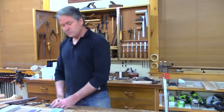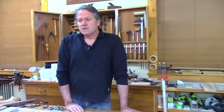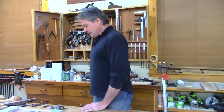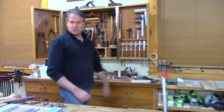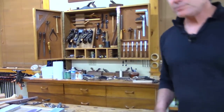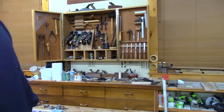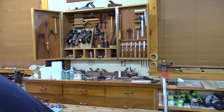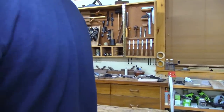All right, Chris is asking, when you say 25 to 30 degrees, is that measured? Yeah, you can check it a number of ways, Chris. Oh, I left it over here. And the grinder speed while you're at it, too. This grinder is a standard 3,500 RPM. And it's an 8-inch CBN wheel.